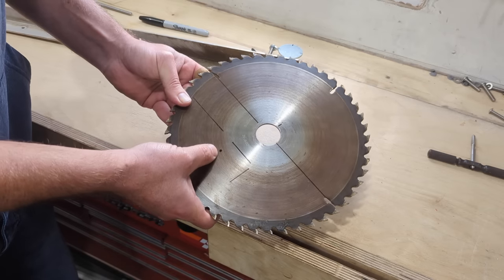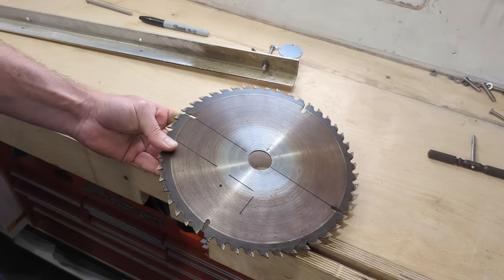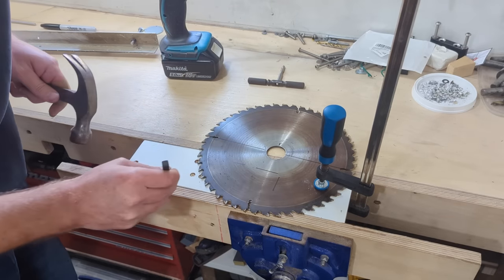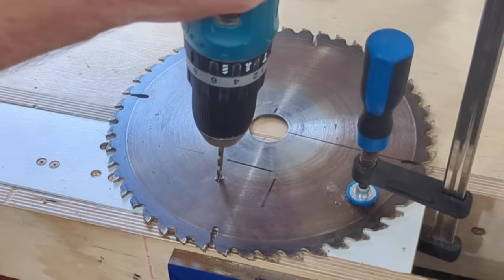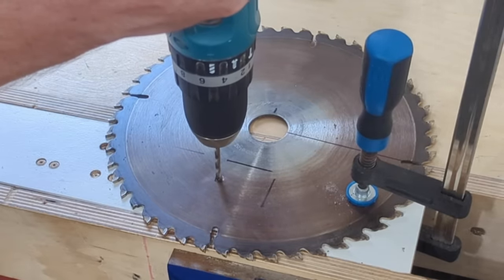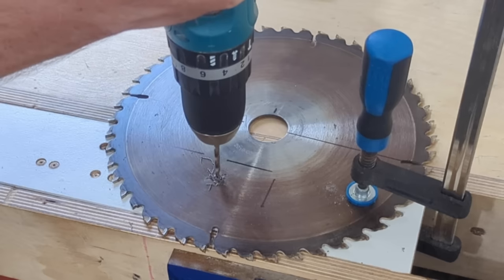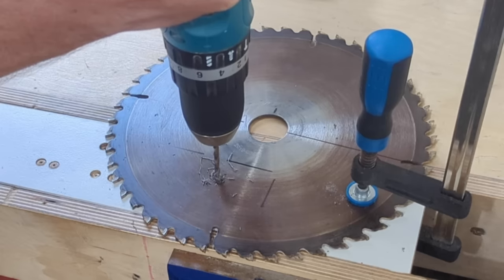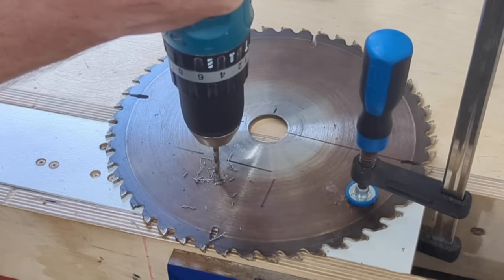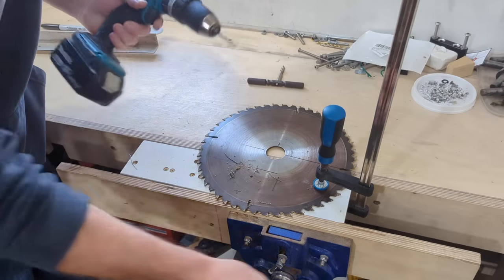So I'm going to attack that with a cobalt drill a bit quickly. We're just going to bung a 6mm hole through there, all being well. Maybe start at 4 and open it up to a 6. We'll see how hard this is, but let's give it a little go, shall we? Dotted all right. That's cool, that drilled really nicely.